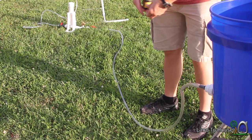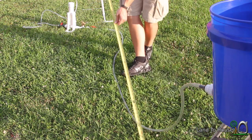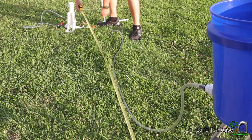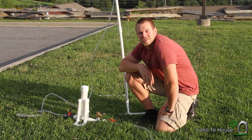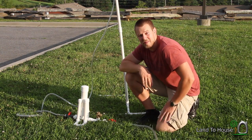Our delivery pipe is 20 feet long. I want to see approximately how long the drive pipe is — it's going to be right at ten feet. So even for a half-inch ram pump, a ten-foot drive pipe is going to be a little bit short.